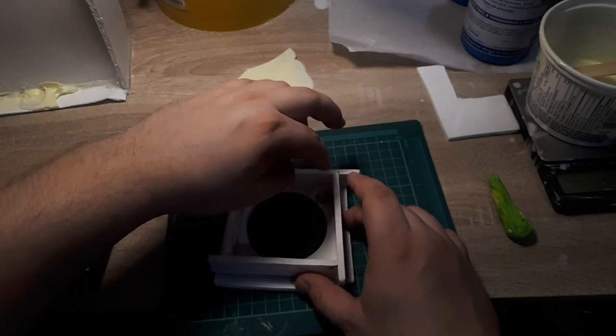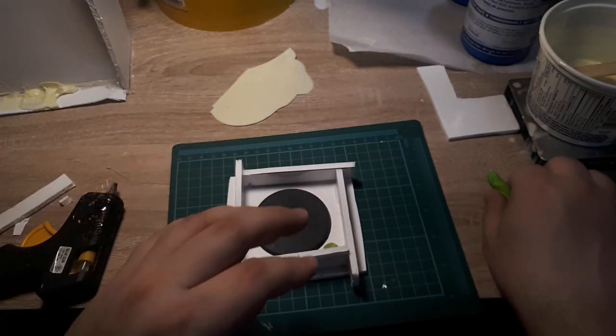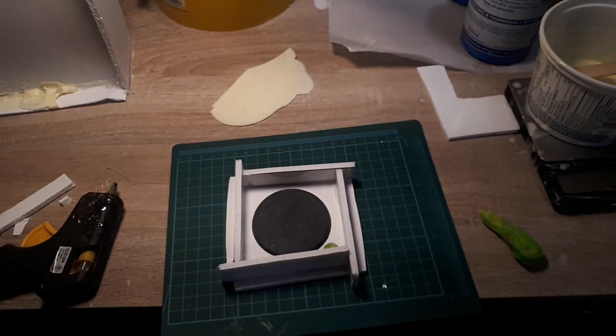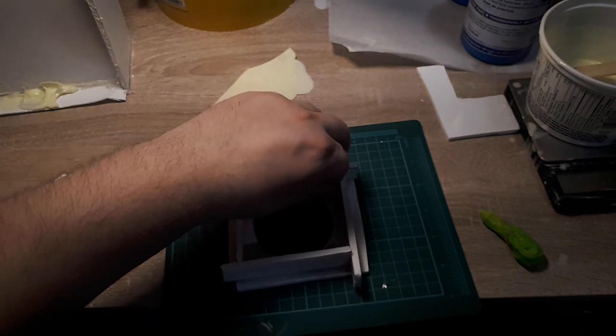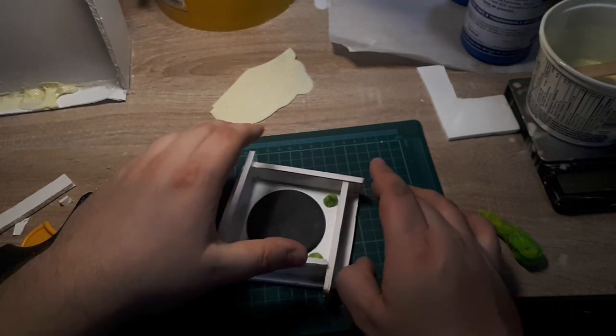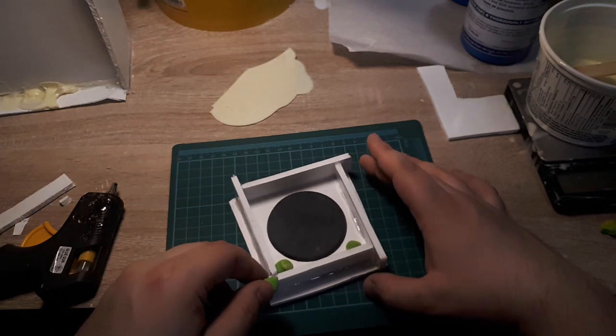Since this was kind of an unplanned endeavor, I figured I was just going to go for a simple two-part mold, which means I had to quickly scramble and figure out how to get registration markers in place. I thankfully had a bunch of plasticine lying around in a drawer nearby, so quickly grabbed that, chopped off a couple of bits, and put together some very, very loosely cobbled together registration markers. These registration marks will help align the two halves together.